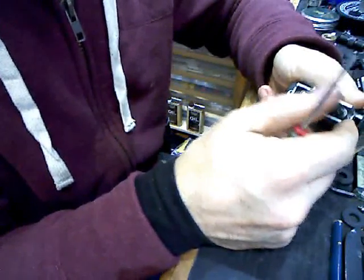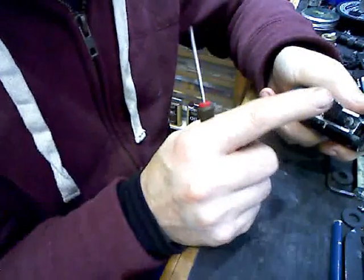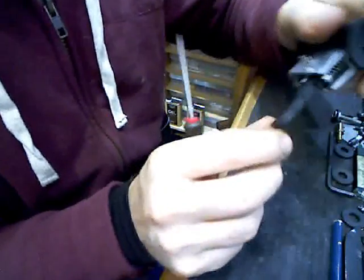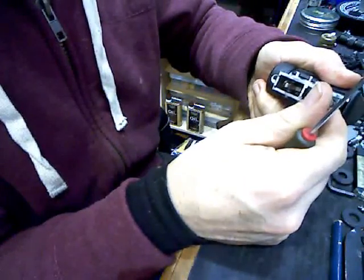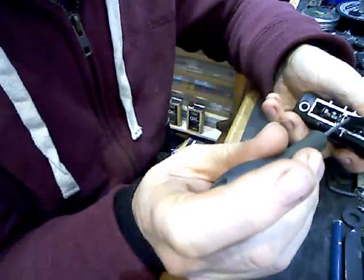Right, definite now. You can see it. So I went about. I'd already backed it off, but I had to back it off even more. Now you see, we've got quite a long first stage. And there's a bit of creep on that trigger blade. Definitely some creep. So what we need to do now is dial a creep out.